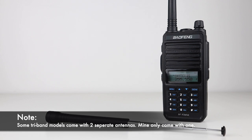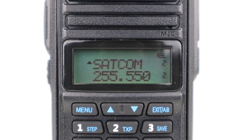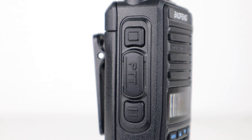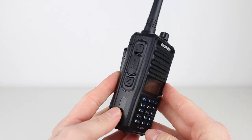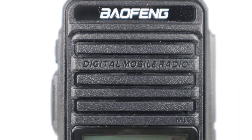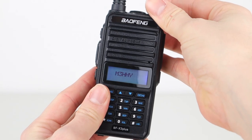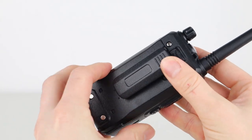I decided to replace mine with the Rubboscopic antenna by Phil G3YPQ — there's a video link and purchase link in the description below for this antenna, which is ideal for all three bands because it's telescopic. The layout is in keeping with most other Baofengs both internally and externally, so if you use Baofeng radios, you won't have any issues. On the left are the two function buttons and PTT. The function buttons toggle things like flashlight, FM radio, monitor function, and emergency alarm, and the PTT is rubberised. On the front is the keypad and function buttons, and just above that is the classic Baofeng screen. Don't be fooled by the digital mobile radio lettering on the front — this is not a DMR, DPMR, or any other digital mode radio.